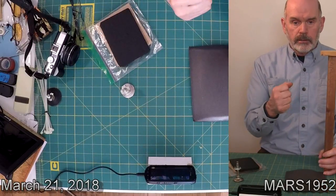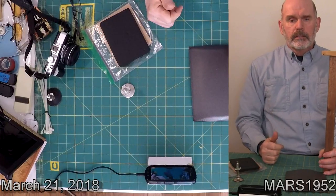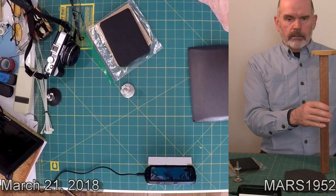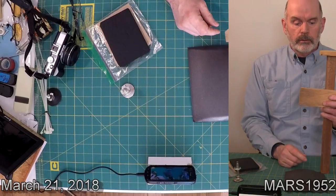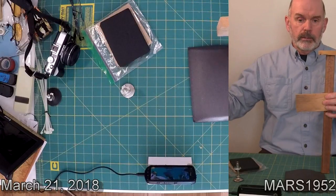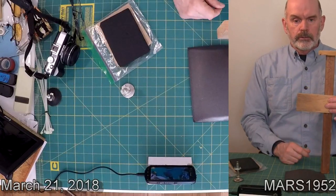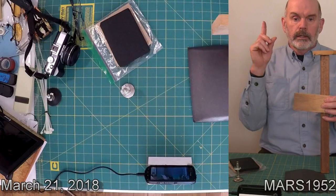So that's all there is to it. You put this up, get a tension between the floor and the ceiling — you don't want it too tight; it has to be snug so it doesn't fall down, but not so tight that you crack the ceiling plaster. Then you take a cross piece — just a piece of scrap, or you probably have to go to Home Depot and buy some — and you can clamp this in place like I did with these helping-hand clamps, or you just do it with a couple screws. I suggest a couple screws.